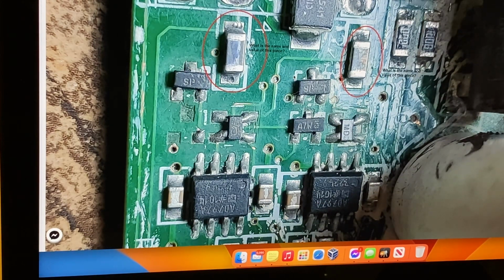The only other thing I should mention that will shut the whole detector down is this big MOSFET here. You can just see it here. Gate, drain, source on the legs. Note these two resistors here, they are supplying the pulses to the gate. They don't usually go open circuit, but this transistor here is a common one to fail. There's a smaller one behind it which does the 15-volt pulses, but I've never had one of those fail.